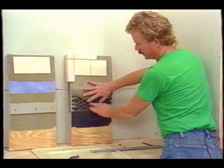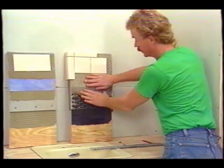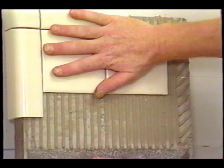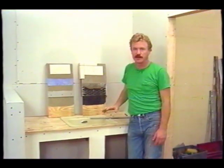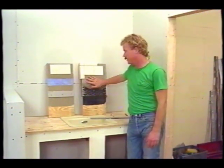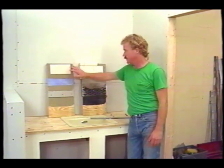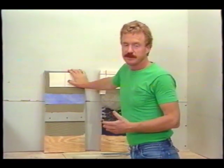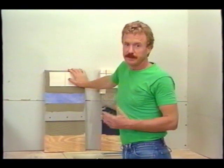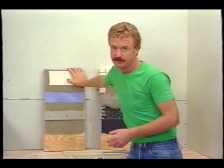Then the countertop itself is filled in with deck mud, which is a dry, crumbly mortar mix. A layer of thin set is applied to this, and finally the tiles are set into the thin set. While both of these represent very strong installations, durable, waterproof, this tape is going to concentrate on the thin set method. A thin set job like this allows you to get started tiling immediately, and then as you build up your confidence, you can move on to more difficult work.